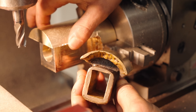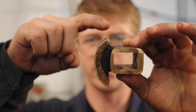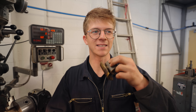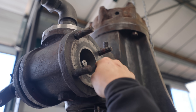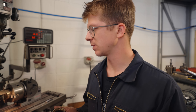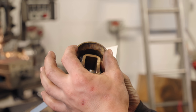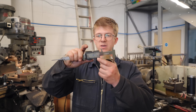That's what she's looking like so far. I need to trim the sides of this. When that's in the valve, the width — or I guess the relative angle of the ends of this bronze piece — is going to be quite crucial. Just like I said in the last video, we don't know if what I see to build off of is actually what it was when it was designed and engineered. We also know we've changed up diameters and the actual bore itself is a couple of millimeters larger. This is a repair job and we're left just completely gambling. I went and took a rough angle measurement to try and work out what I think is the key component of this valve, and these handy-dandy drawings read that as 103 degrees. I also have a width measurement here, about 52 millimeters.